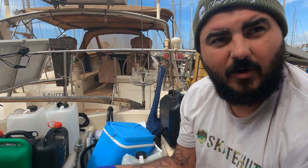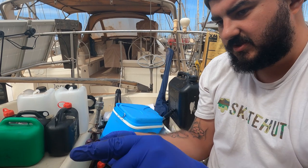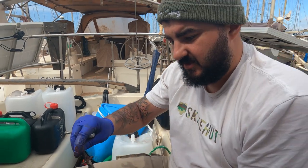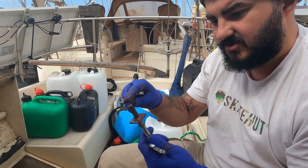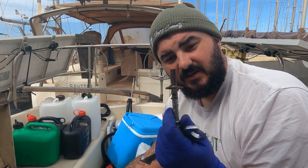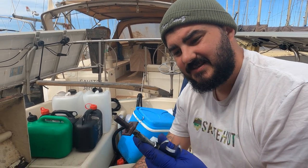It's basically just Sikaflex or some sealant holding the bolt plate in place. The design seems a bit flawed - if they welded something between the two bolts like goalposts, it would stop them spinning. This is likely a problem for other people too because this area is exposed to the sea, so it'll get corrosion and fouling. But it's done now. Next stage: clean it up a bit more, put sealant on and tighten it into place.